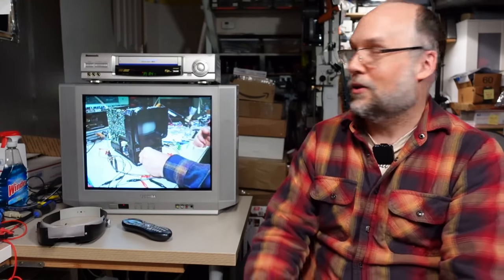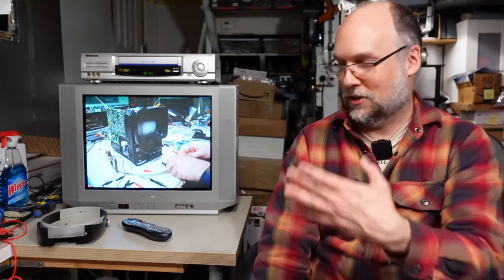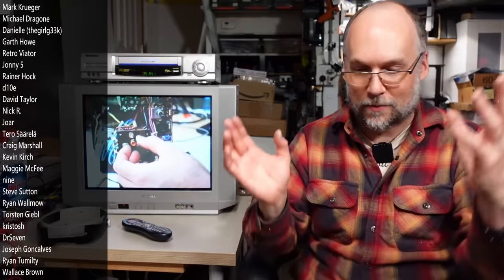So there you go. And then, oh yeah, the VCR decided to give up the ghost as well. But that turned out to just be clogged heads and was an easy fix. Big shout out to 12 Volt Vids. If you want to know all about fixing VCRs and pretty much everything else, his channel is really good. I'll link it down below. I learned that trick with the paper and cleaning the heads from him. He used to be a Sony tech, repaired who knows how many VCRs and camcorders for Sony Electronics, and that was the method they used, apparently. So if it's good enough for Sony, it's good enough for me.